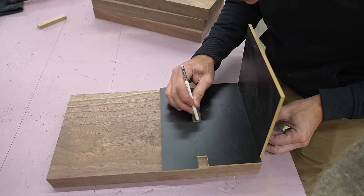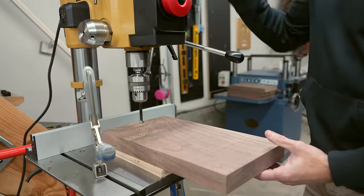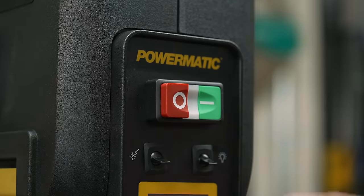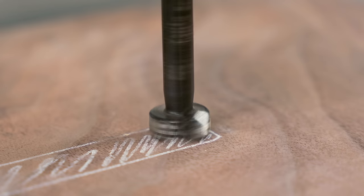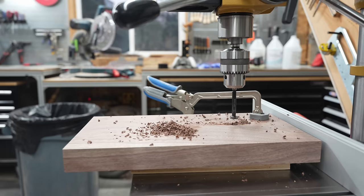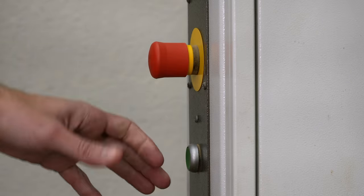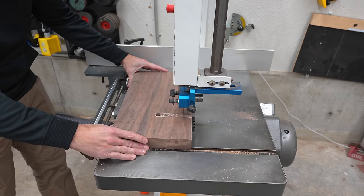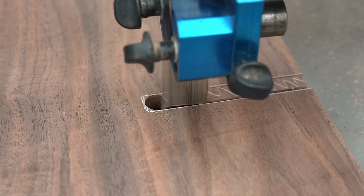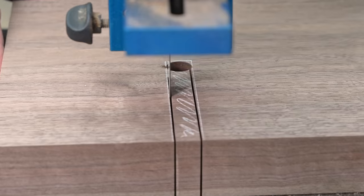That small piece of walnut you see there is an off-cut from the actual shelf, so I'm using that as my spacer. The fact that it's the exact thickness of my shelf is very important, and you'll see why in just a minute. I've used templates, which are available in the woodworking plans if you want to follow along. Up till now I've basically just been cutting squares, but this is where you actually need to pay attention. I'm using a drill bit just smaller than my three-quarter-inch shelf — none of this has to be precise, I'm just cutting close to my line using my bandsaw. You could also use a jigsaw. The only critical thing is don't go past your line, because we're going to use that off-cut spacer and those templates to get an absolutely perfect fit on the router table.